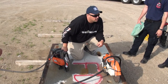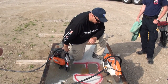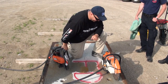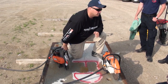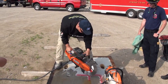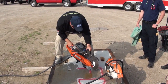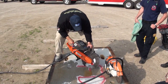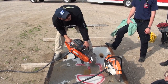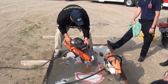If you're seeing powder, you don't have enough water. If you're seeing clear water coming out the back, you've got too much. As far as stance, get into a position where you can cut comfortably. I like to set this thing in and rest my elbows on my knees, keeping hands on it — because anytime you start flexing and taking steps you're going to bind that blade up and burn it.